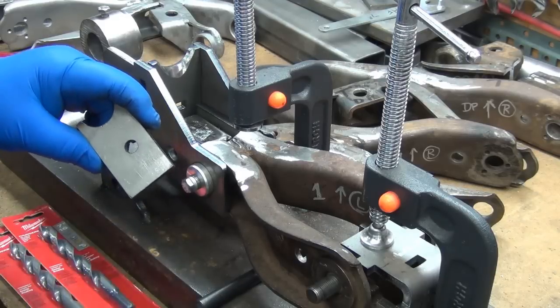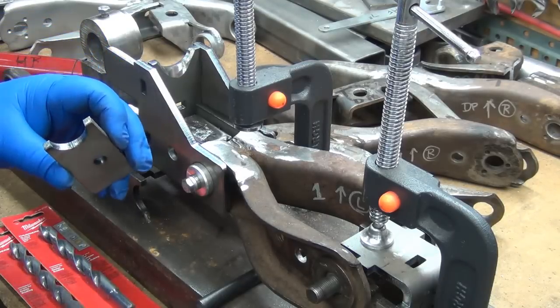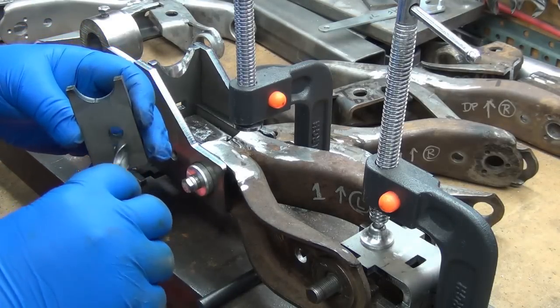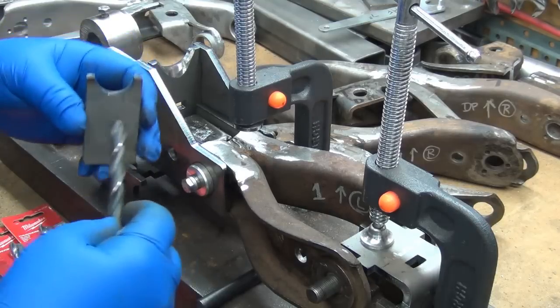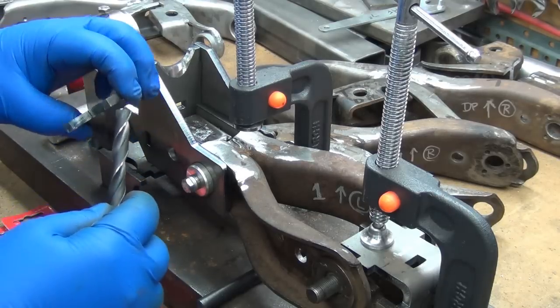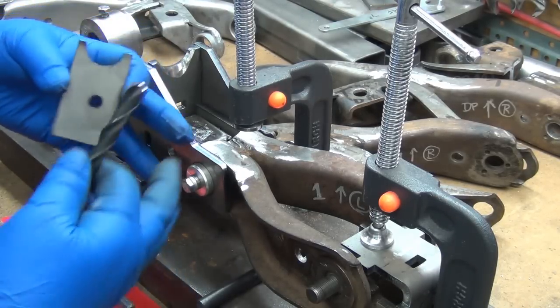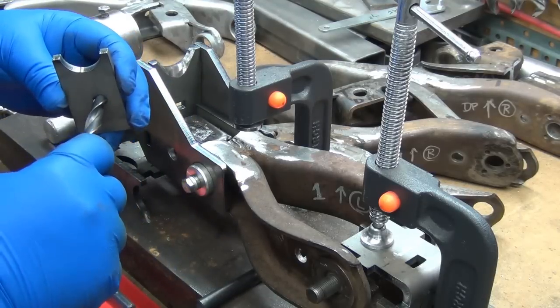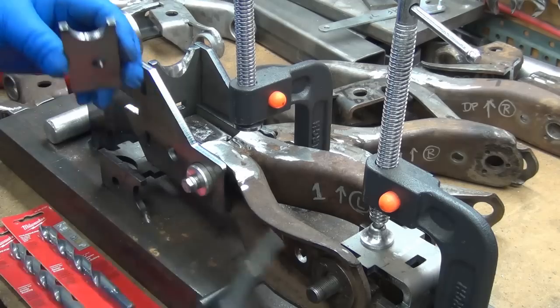And this is actually a little too big. I think I've talked about this once before, but when you've got a big pilot hole like that, it needs to be down closer to 1/8 inch, 3/16. But then the laser cutter has a bit more trouble with that, especially on this. From what they've told me, I shouldn't go with a smaller hole diameter than the thickness of the plate. So I could put a 1/4 inch pilot hole in there, but when it gets so close, it's so easy for the bit to wander around.